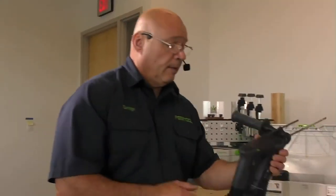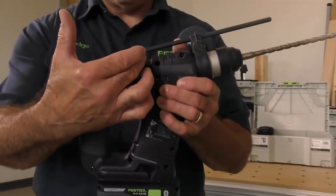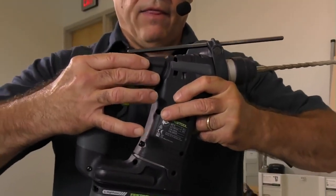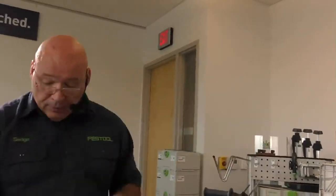It's a multi-use drill where if you're drilling strictly in concrete all day long, this is a lot faster. And a big, big call out for this is you'll see this part between here and here on the rotary hammer. Check this out. That is called vibration stop. And that little buffer, if you're drilling into concrete all day long, will let you drill more holes.